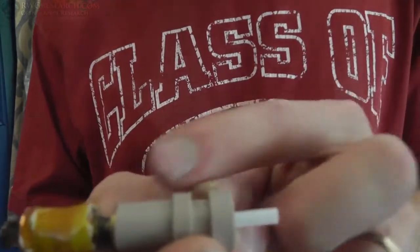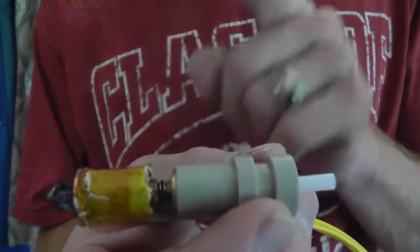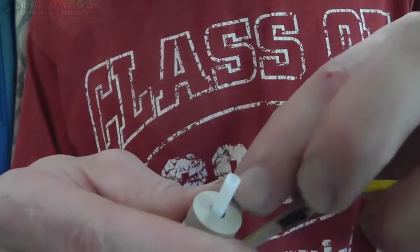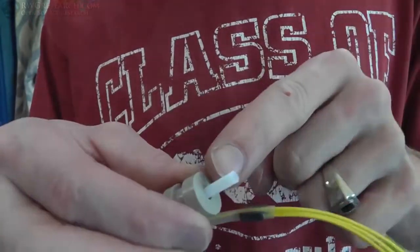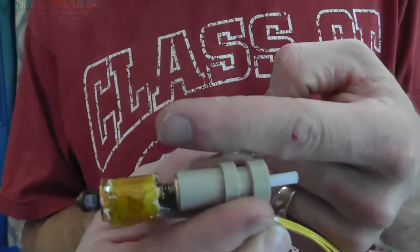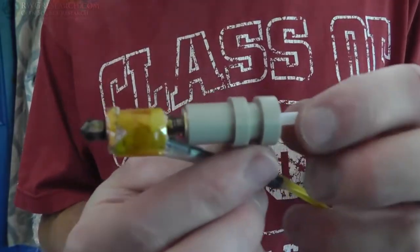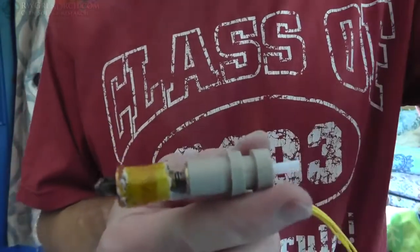Now the other problem is if it is that soft and you try to push something into it, it has the potential of trying to slide forward and actually clogging the end of this. So the solution for that is to create a little insert that goes in here that's made out of probably aluminum. That's what I'm going to use anyway. I could even use this plastic now that I think about it. Might be a better option. But basically I'm going to make an insert so that I can thread something into this PTFE tubing and allow it to be held in position so it can't be pushed down. So you're constantly not allowing, by a pinch point here, that to be pushed into the hot end. I think that might be causing me some issues on the other stuff. This stuff gets pretty soft when it's hot. So I think I'm going to do that, and that'll be the last thing I need to do for this.